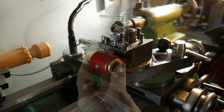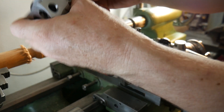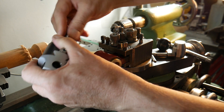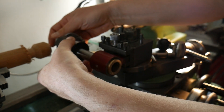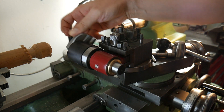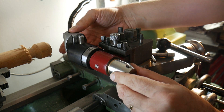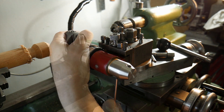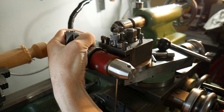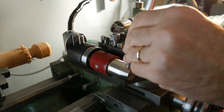Finally I start to assemble the device. I put the round bar in the turret of my lathe. With some oil I insert the shaft of the boring head into the bushing hole — the tolerance is very tight so it is not easy to insert the shaft into the bushing. The round bar with the 20-degree bevel has an M5 screw. With this screw it is very easy to regulate how the cap pushes into the bushing. After checking, I screw the M8 handle into the M8 hole on the round cap.